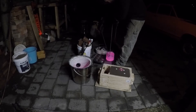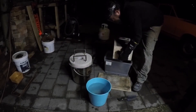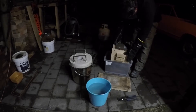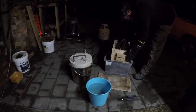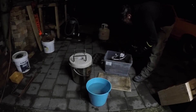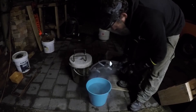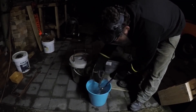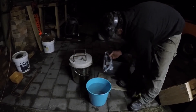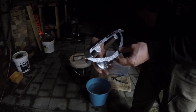All this aluminium is from a video I did cutting up a mag wheel, and it's lasted quite a while. To break the casting out of the sand, I pop the mould over the bucket I store the sand in and let it drop in — I find it works pretty well and I don't seem to lose too much sand that way. A bit of a tap to get any sand off it, then ready to cool it down. I need a bigger bucket — and a metal one would be nice. With that done it's cool enough to touch; it doesn't take long in the water. But do be careful — make sure it's cold first.